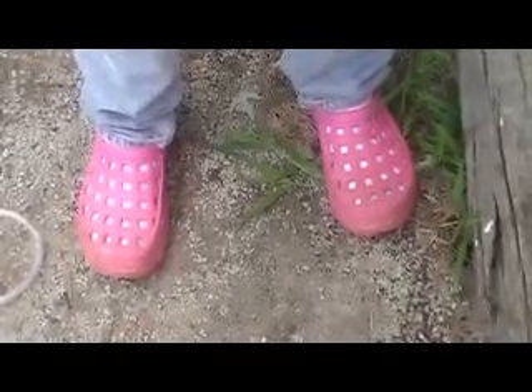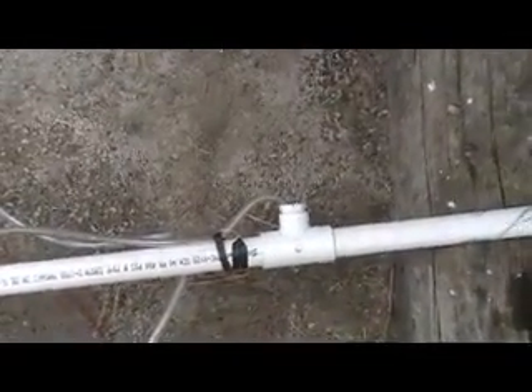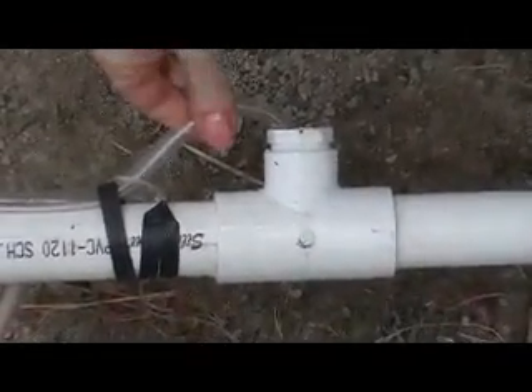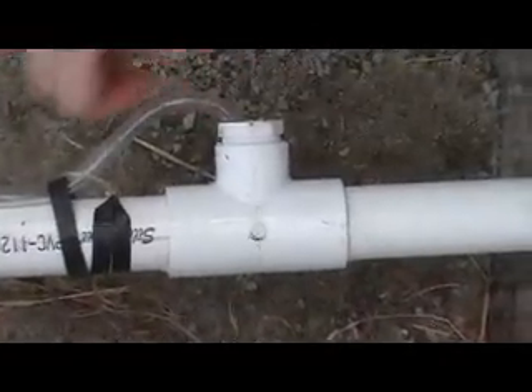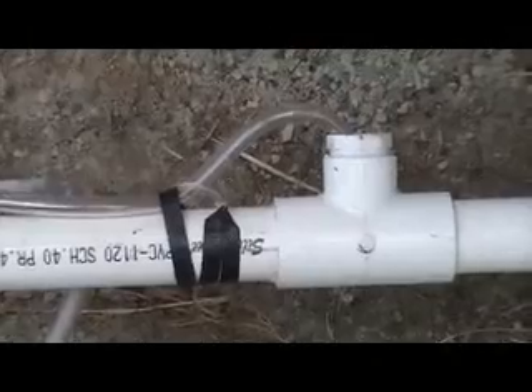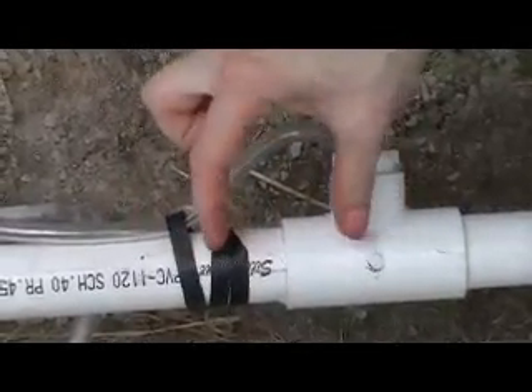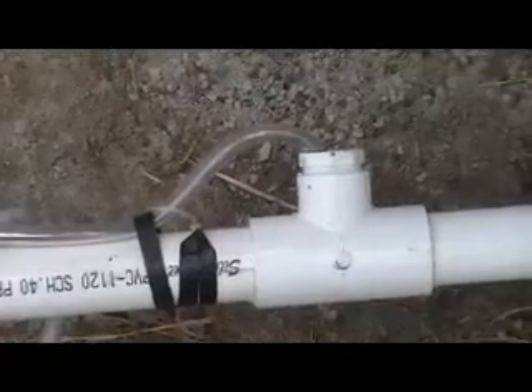Hi, I'm Norman, Kathleen's partner in this. So this is a bit of the engineering of what we did. We have the air pipe coming into a T-connector. The air tube is perforated at the end so we get little bubbles coming out inside the pipe. The air tube only goes up the pipe maybe an inch or two at most. We plug off the end so we don't have big gloppy bubbles.